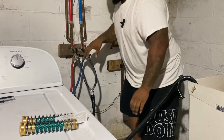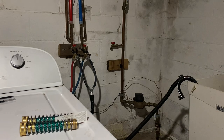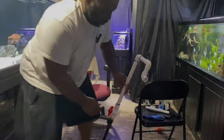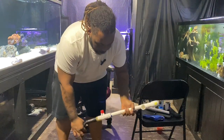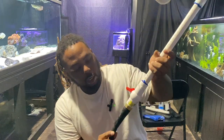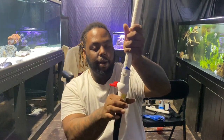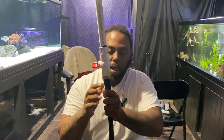Okay, no leaks there whatsoever. Let's go back into the fish room and I'll show you guys how I'm gonna pump the water in. First thing first, I'm gonna turn the ball valve off, then I'm gonna turn the water pressure on and make sure this thing is not leaking. I do have a small leak right around where the brass meets the PVC — it's not a big deal. I'm gonna go back and put some Teflon tape on there and that'll get rid of the leak.